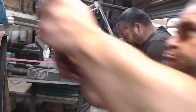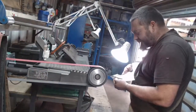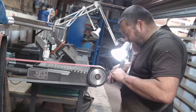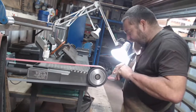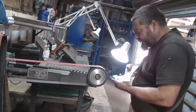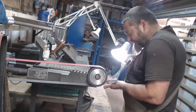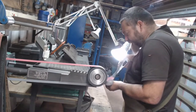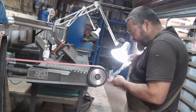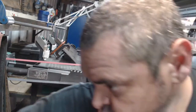What did you gain? I will be doing a red satin. So a red surface conditioning belt, SEM medium. A lot of guys are calling it a Scotch Bright belt. It's not. It's a surface conditioning medium. So that'll be the surface finish that you would get on house appliances, any commercially bought knife. That's straight machine finish.